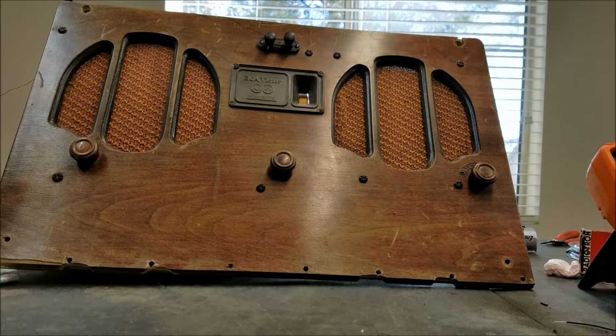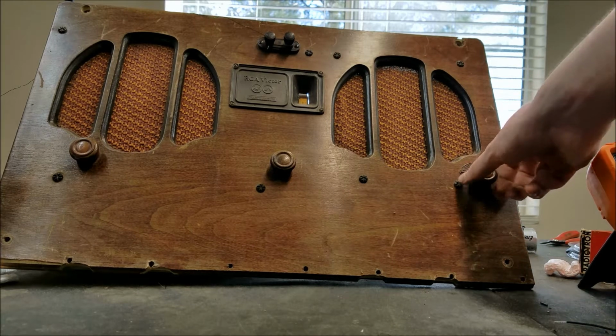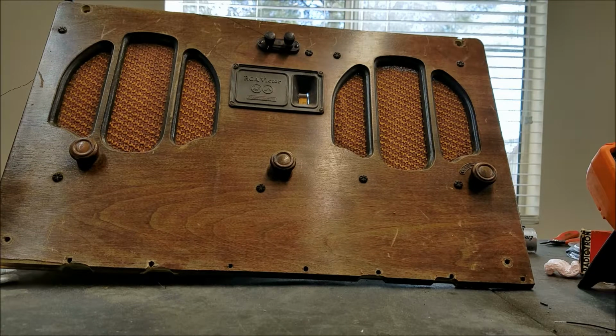So that's going to be about it for this video. We did get it playing. I'll turn it off, leave it off for a minute or so, and then turn it back on and see if it comes up loud and then slowly dies down. So yeah, I think that's going to be about it for this video. I'll have to order some tubes to play around with, and in the meantime I'll work on replacing the out-of-tolerance resistors and replacing the capacitors. See what happens.